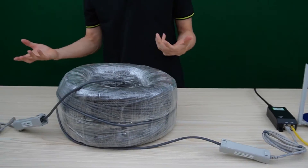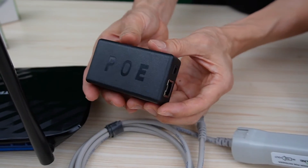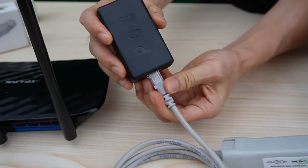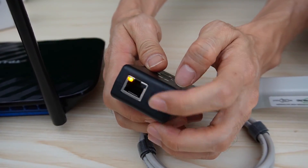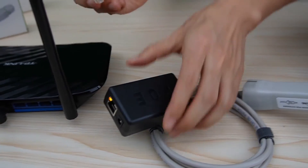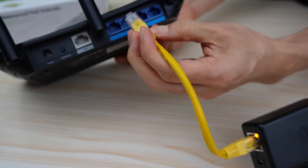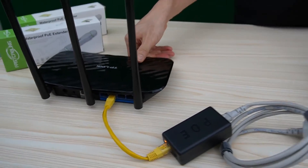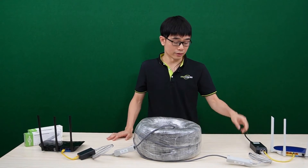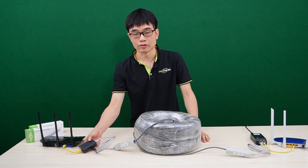Now we need to move to the second router, and we still need another device — this is the PoE splitter. I'll explain why we need the PoE splitter. Let me connect the PoE splitter first. You can see the power indicator is on, which means the whole system is up and both PoE extenders are getting power. And the last short patch cord links the output port to one of the data ports on this router. It's easy to understand why we need the PoE injector — we need power going through the Ethernet cable so both PoE extenders will get power. But why do we need the PoE splitter?